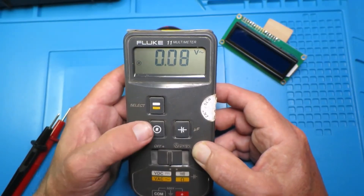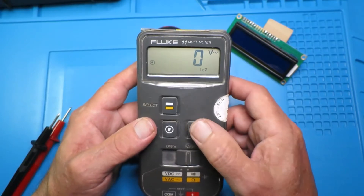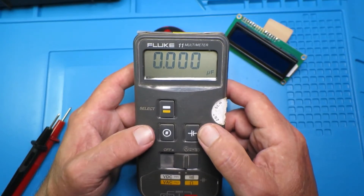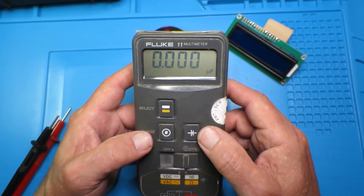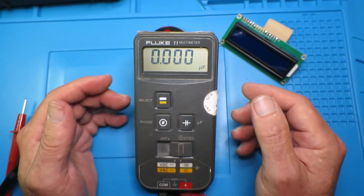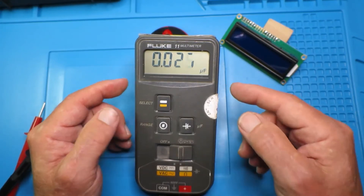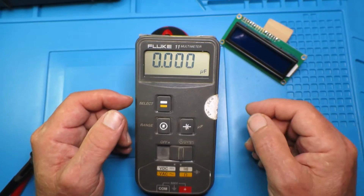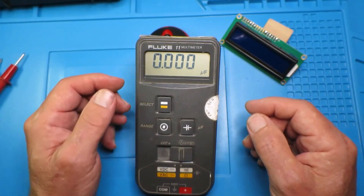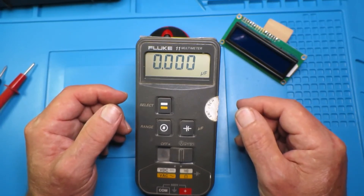The little buttons down here for the range, they're fine — these buttons are working fine. I have taken this apart many times and fixed it for a while. The issue is what's called the elastomers inside. Essentially the switches are connected to the circuit board via little rubber elastomer strips, and they get compressed over time and dry out. You can jiggle around with them and try packing the circuit board up a bit, and that works for a while. I've even heard of people boiling them.